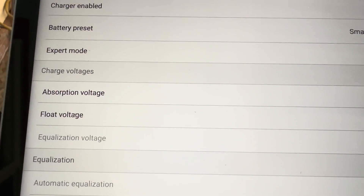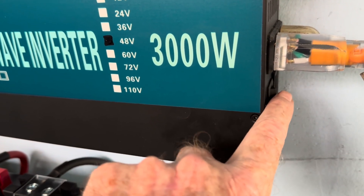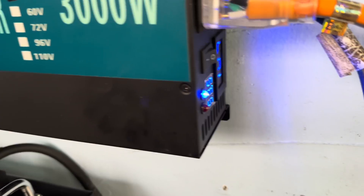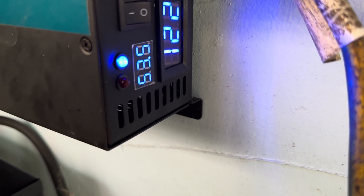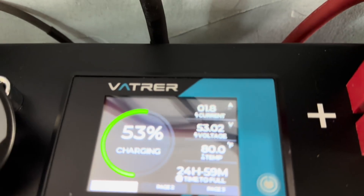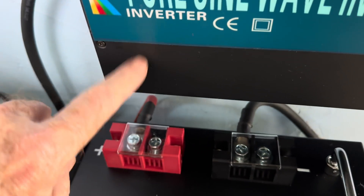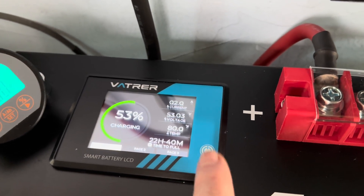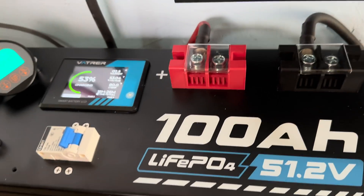The float is set to 54 volts. Just to make sure everything is up and operational, I'm going to turn the inverter on — and it is on, doing fine, reading 53.5 volts. The battery display shows 53.02, so very close — just a little discrepancy between devices. I like this interface; it's pretty nice. Let's turn this back off on its way to a full charge, which hopefully will be tomorrow.